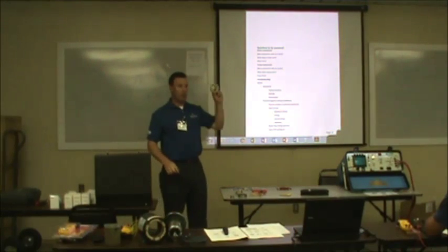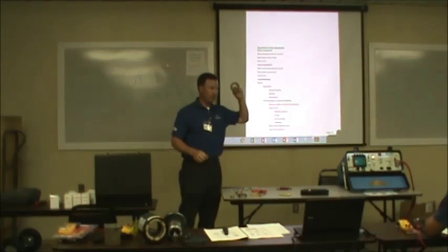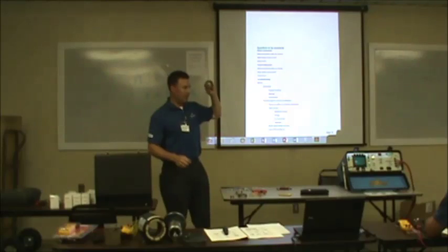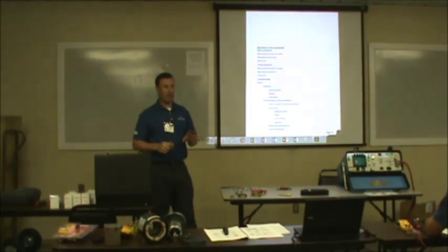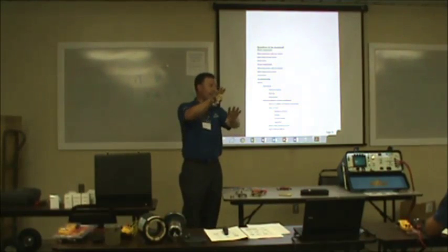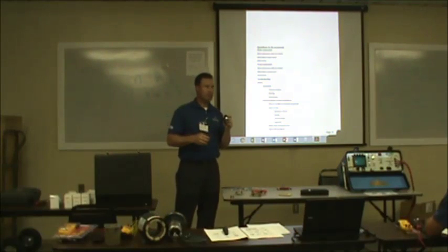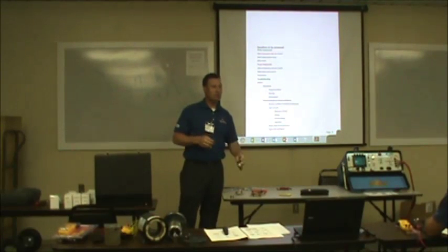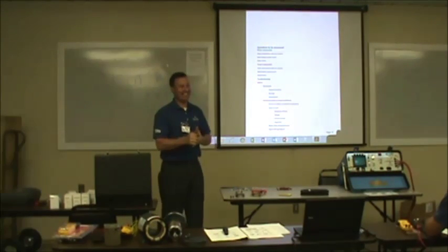Now, submersible pumps, a lot of your pumps, these run in oil, so they don't have to have grease. So we don't have to worry about it. Now, I know Greg's got some pumps that are not oil-filled motor housings that you have to grease. I mean, he can't grease them. They come pre-greased for life. And that's about a year and a half or 2 years.